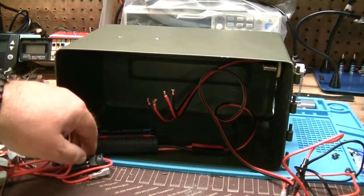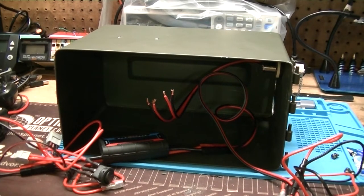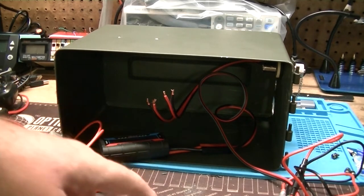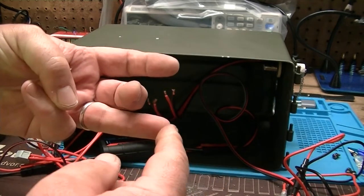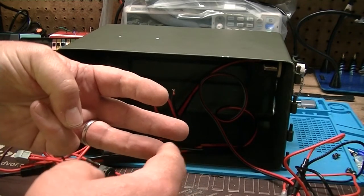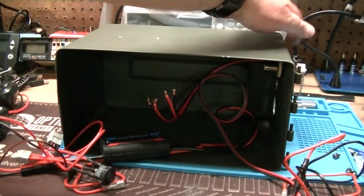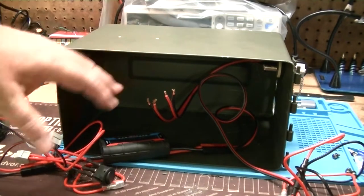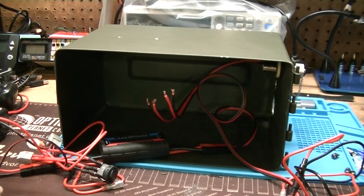Down the road, I didn't have one here. This is a single pole, single throw switch. I've got one ordered. I'm going to change it out to a double pole, double throw switch. So center will be off. It'll have 3 connections. Center is off, and then it can be hot on either side, but not both at the same time. So that way when I want to run everything off the battery, the radio, etc., I'll just turn it on. When I want to turn on the extra power charger, I can turn it on and it won't run anything else. There's a couple ways you could do that. It'll work the way I'm doing it with always hot connections, but I like it to be switched. I just didn't have one, so we're not going with that for now.